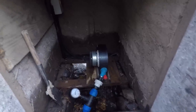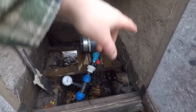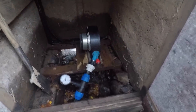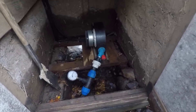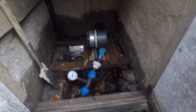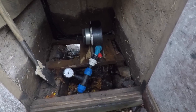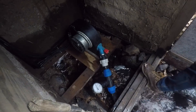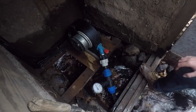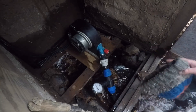Let's check out the turbine. Here is my homemade turbine, which I made in my shed — running like that 24/7, currently at 300 watts. There is some damp getting splashed up from the turbine, so I'm going to need to board out this whole area to stop that. The pressure down there is about 25 psi, and that is a three-phase Pelton turbine. It goes into that little box in the corner and the power makes its way over to the shed. I've got up to about 68–70% efficiency with it, so it's quite good.